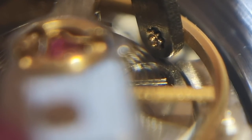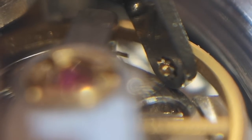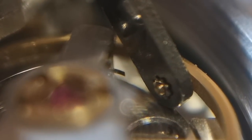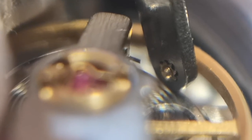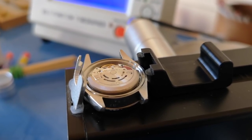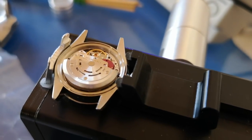You can see here that I've got the tool sliding along the nut on the thread on the inner side of the balance wheel, and I'm just going to give it a little turn. You have to be really, really careful when you're doing this, and you need to hold the balance with a pair of tweezers because you don't want any pressure on the balance staff pivot. Just turning it back now because I overdid it there a little bit. But this is the Microstella tool in action. We've done the regulation now on this little Rolex 2135 movement.